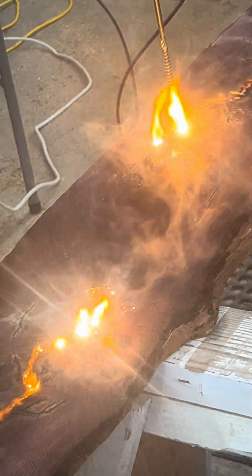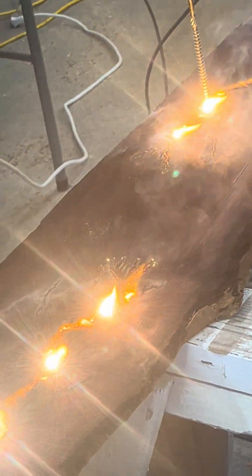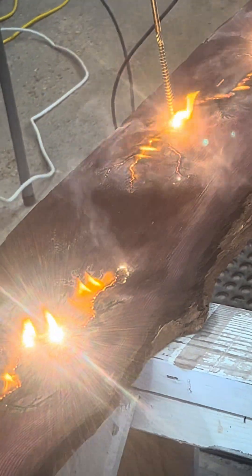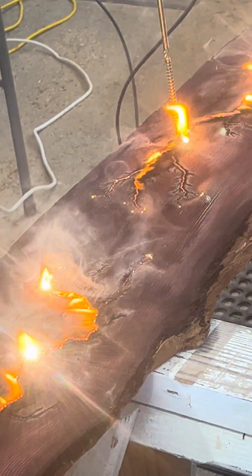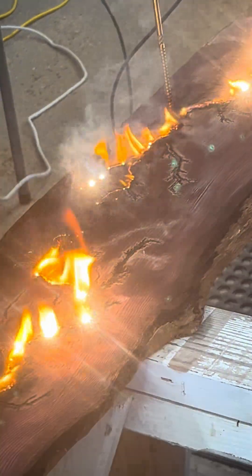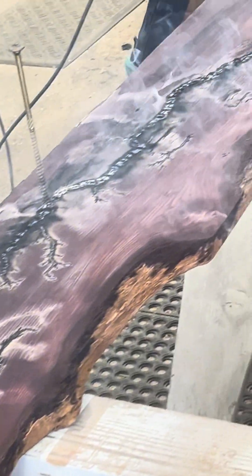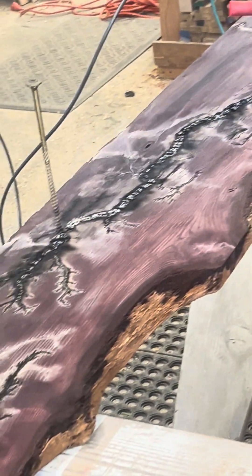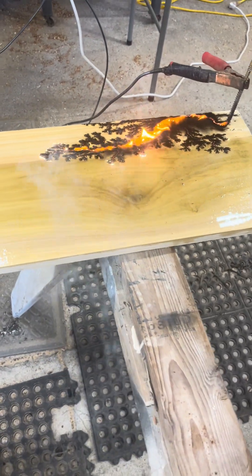By the way, a Lichtenberg figure is named after a German scientist, Georg Lichtenberg, who is said to have discovered these patterns in 1777. It is sometimes referred to as frozen lightning because it's basically what's happening here — but on wood. The formation of Lichtenberg figures is the process of electrical breakdown in an insulator. The figure is basically the same process as lightning bolts, but because our insulator is solid and not air, it leaves behind this beautiful design. A Lichtenberg figure is basically a channel through an insulator created by a discharge of electricity through or along it. The pathway follows a fractal geometry and branches out as the voltage seeks the path of least resistance. Every burn is therefore entirely unique.